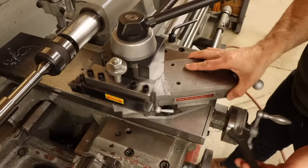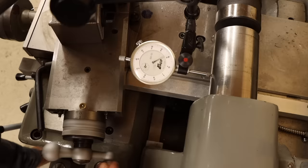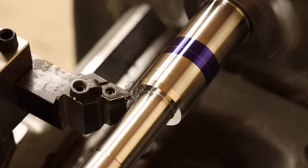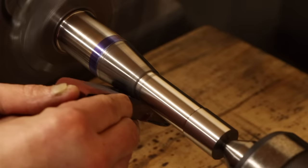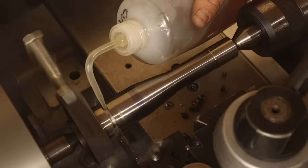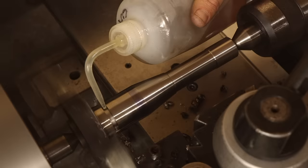This taper angle is important because if I get it wrong, it won't work right in the mill. So I'll use the indicator displacement method to dial in the angle of the compound. Then scribe the stopping point with a threading tool, and finally switch to a regular insert tool to cut the taper. Once I reach that scribe line, I take a couple spring passes to ensure I truly cut the correct angle, then give this a final polish with emery cloth to bring the finish up to par with the other turned surfaces. That wraps up what I can accomplish while turning between centers like this. But while I'm here, I will begin the parting cut while I can still easily measure from the end.